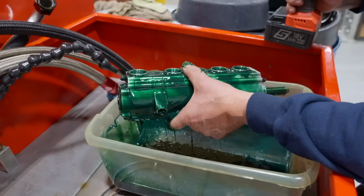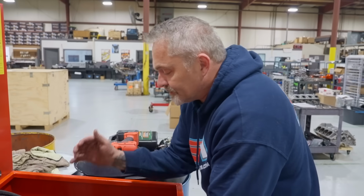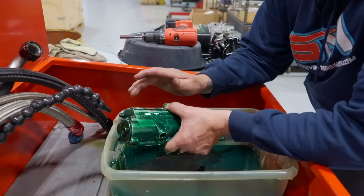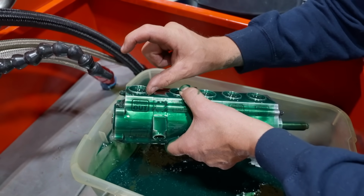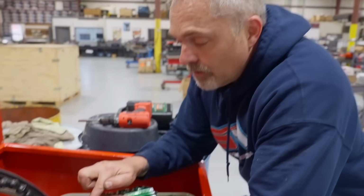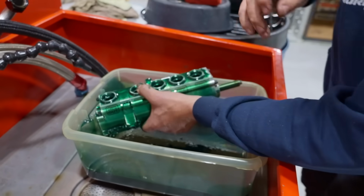No bypass in it. We could actually put the bypass in it. I've done this before just for kicks and giggles. It doesn't do anything outside of just helping you set up the bypass. I can put a plug and a gauge on that pressure outlet and have an inlet hose coming here, so it'd be just like it was on the engine, except that it would make it bypass all the oil. That would tell you where your bypass spring is set up, plus or minus a little bit, because it's not exactly perfect since it's going to try bypassing more than normal.